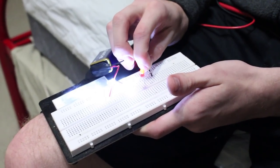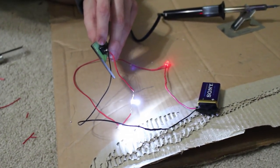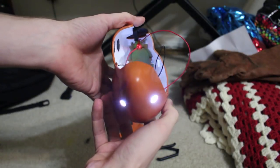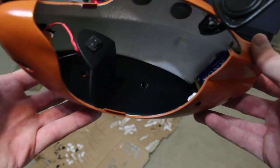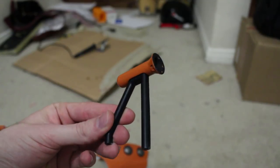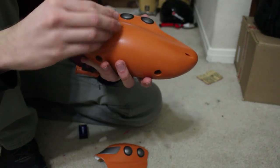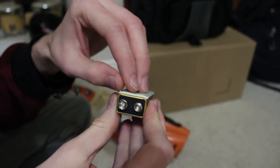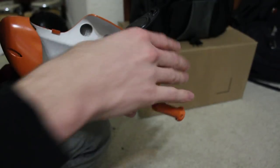And now it's time for the electronics I talked about earlier. A simple breadboard setup was done to verify that all the lights work. Once I saw everything was good, I soldered together all the components with my friend's help. The lights were then superglued into place and the wires, switch, and battery were just loosely set in the hull. With the battery pushed back as far as it can go, the floor was added to conceal all the wire routing. The next thing was to secure the control panel in with two M3 bolts. I also attached the arms and the motor pods — the pods had already been glued to the arms off-camera, so I just glued both assemblies to the submarine itself. A piece of double-sided adhesive tape was added to the battery and then it was pushed back against the wall.